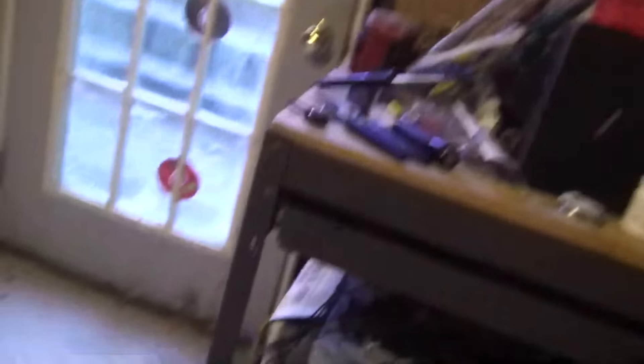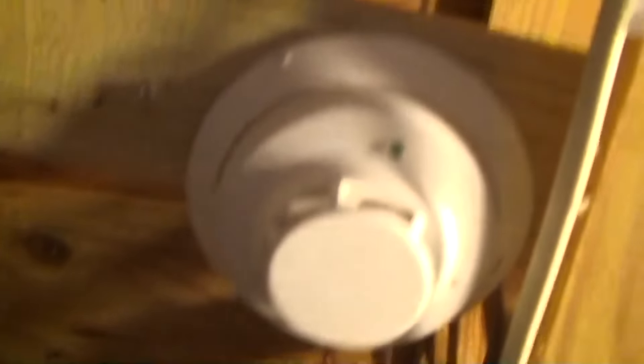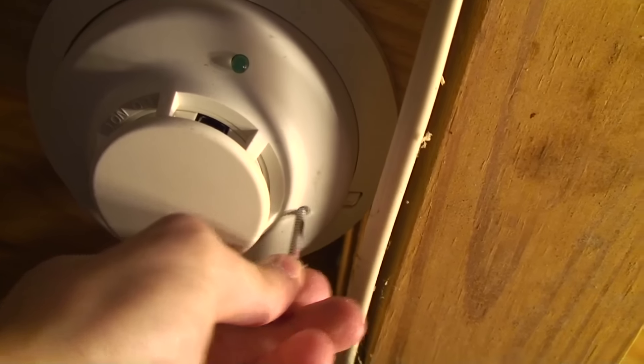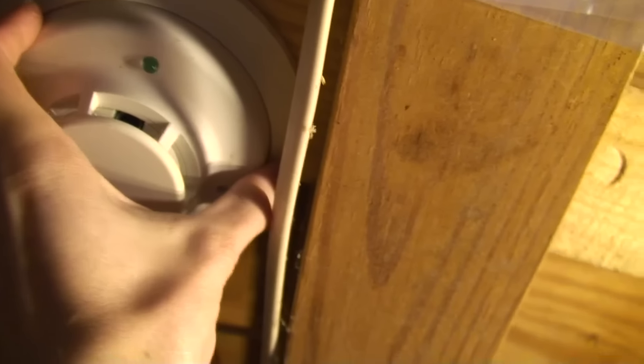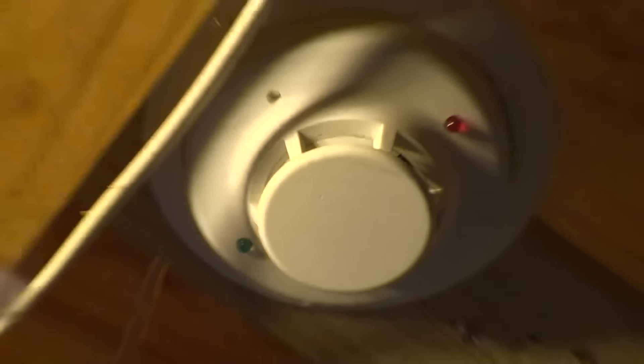Oh, I forgot to activate the smoke detector. I'll show you a flaw with my panel, actually, just as a bonus. As you know, walk test is supposed to turn off the horns when the initiating device turns off, right? Well, here's the problem: when you activate the smoke detector, the system stays on unless you take the smoke detector down and put it back up — but I can't. When I build the new panel, I have to set up some kind of system of time delays, relays or something for a walk test, so that it self-resets after a certain amount of time.